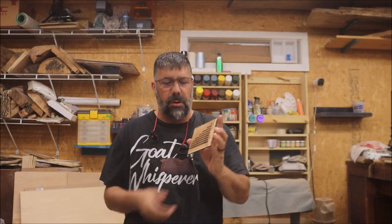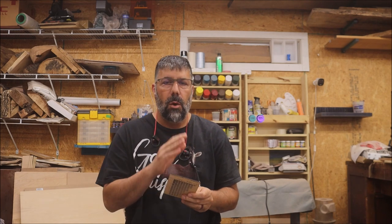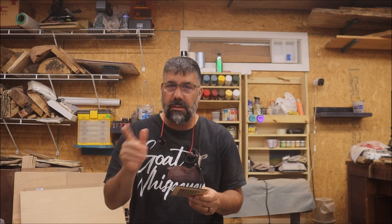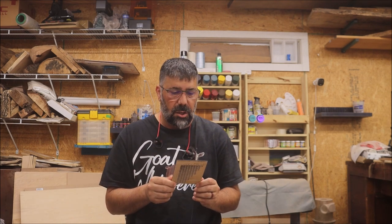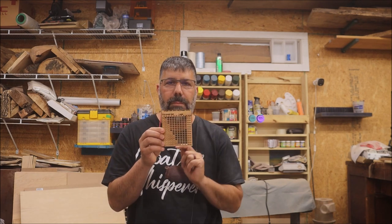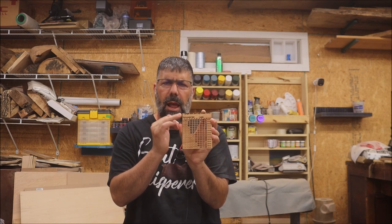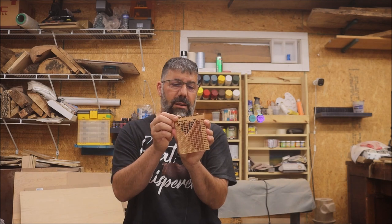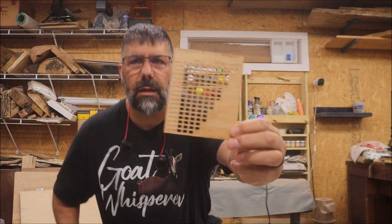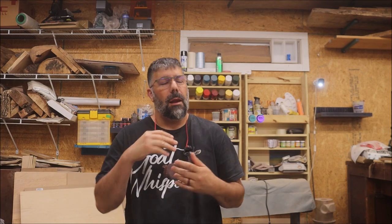Let's go over to the cutting. Wow — I have to say this thing cut beautifully. There's no charring on this, and I think that has to do with the automated air assist, which we'll talk about in a second. I was really impressed. I did set the letters too high — I had it at 9,000 millimeters per minute at 30% — and it cut through with no charring on the back. Overall, it cut and engraved very beautifully.